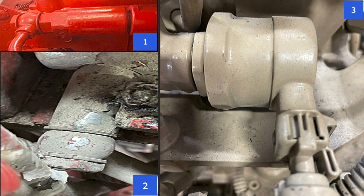On that QSX 15, the relief stuck shut, the actuator circuit went open, and the injection pump made so much pressure that it actually cracked two pump heads. They replaced the first one, and when the second one cracked they called me asking why. That number one relief, painted red in the picture, has a very heavy spring inside with two cups — one rides inside the other against a flat seat. There's a very small, about one-sixteenth inch hole drilled in there and they open in two stages slowly.